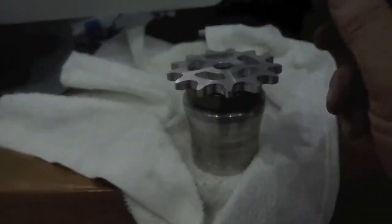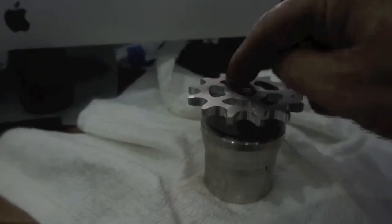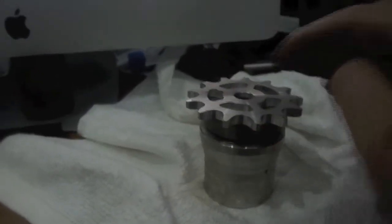Okay, I don't know what the light's like here, but on the bench or on the computer desk, this is tonight's effort. It's still hot. It's a bearing housing, just a plain shaft with 2 ball bearings on it. This end is threaded. So the idea behind this is it'll be bolted onto the framework of the starter stand or the test stand. This will be bolted on through these slots onto here.